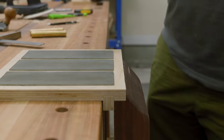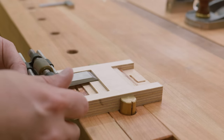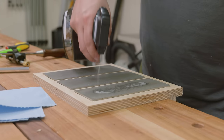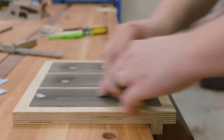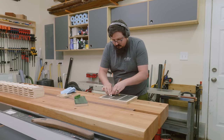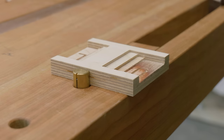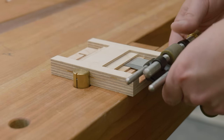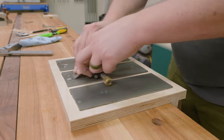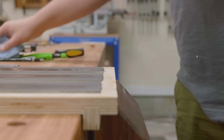Now that the sharpening kit is complete, let's put it to work. I'll first use the top portion of my block to set the initial 25-degree primary bevel. I really like how this allows me to register the blade as well as check the honing guide for square, all in one step. Then we can head over to the diamond plates. I'll first start with my medium to coarse diamond plate, which is about 400 grit. Once I've applied some auto glass cleaner to the plates, I just take about 20 strokes on each, working from the medium to the fine, and then finishing with the super fine. Make sure you're buying a quality diamond plate — the quality ones use monocrystalline diamonds, which ensures your diamond plates last a long time. With my primary bevel done, I set my secondary bevel to 30 degrees, doing about 10 to 15 passes on my highest grits — the 600, which is fine, and the 1200, which is super fine. Then I use the edge to pivot the blade onto the stone and remove the burr from the back.